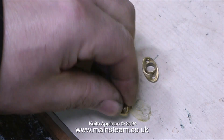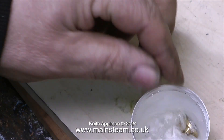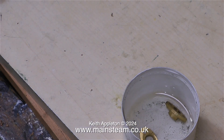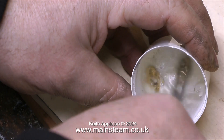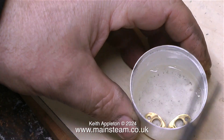And now without further ado, here they are — two very oily identical flanges on the bench. I'm going to be silver soldering these so I'm sitting them in a small pot of cellulose thinners, which is called lacquer thinner in the USA. I gave them a good stir and then removed them using surgical forceps — health and safety etc.